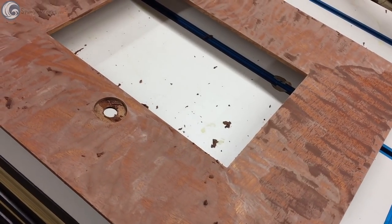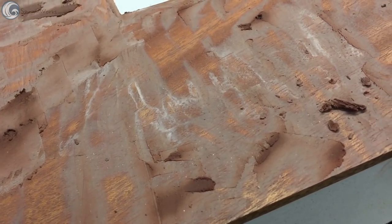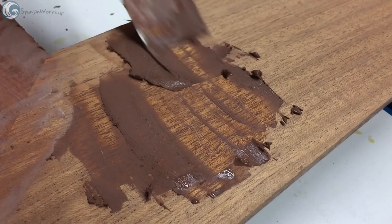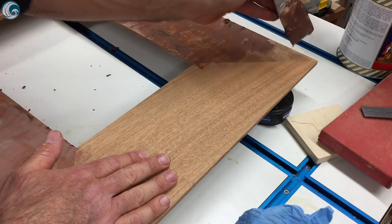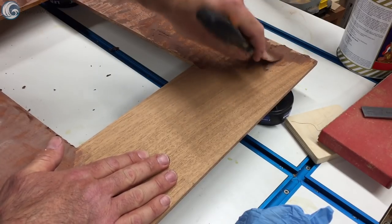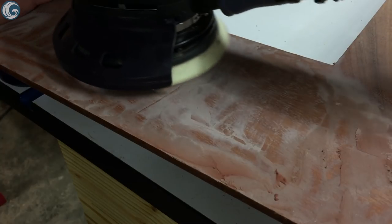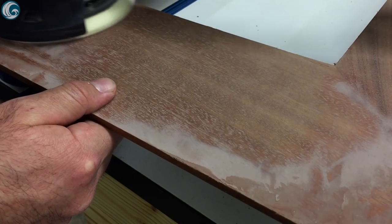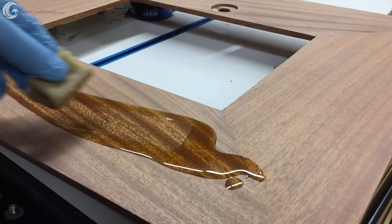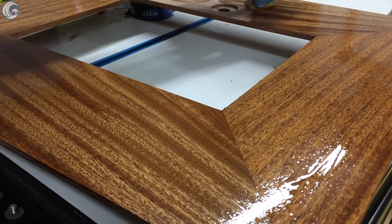Back to the top surface of the frame — I'm using a gloss varnish and I want it to be a consistently smooth surface, so before finishing, I fill the grain with wood filler tinted with brown mahogany TransTint dye. The filler is pressed into the pores with a putty knife, moving perpendicular to the grain. If you press it in parallel to the grain, it may be pulled from the pores. The filler is allowed time to dry, and then it's sanded with 80 grit up to 220. I applied four coats of varnish, each coat having ample time to harden with a leveled sanding between coats.